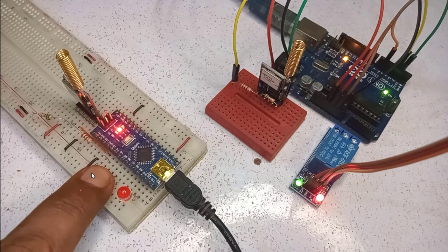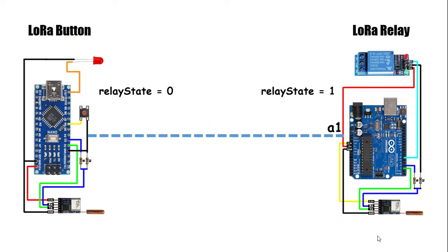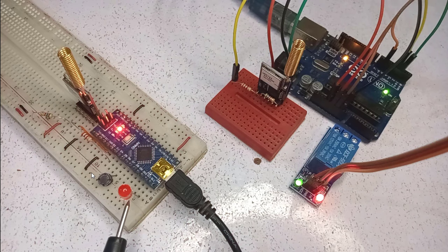The same button will be used to turn on or off the relay on the receiver device. To ensure smooth communication between both devices, the receiver constantly sends the relay status back to the transmitter at regular intervals of 3 seconds. The LED connected to the transmitter side is continuously blinking, indicating that the relay status is being received from the receiver device. This synchronization process ensures that both devices have the same relay status at the same time, and is required to handle any data loss that may occur during transmission.